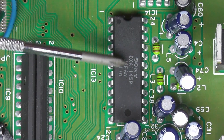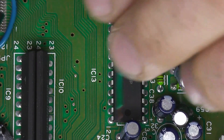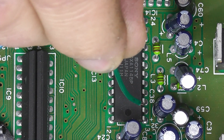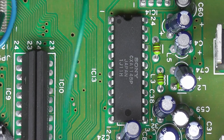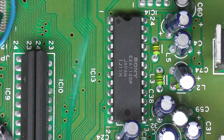If you're using thicker wire, you might not be able to get it in there without hitting one of the other pins. So what I'm going to do is solder right to the actual legs from the top here. It's good to have a decent soldering iron with a smaller, pointier tip to get in there with it.